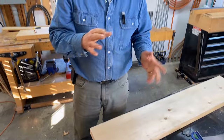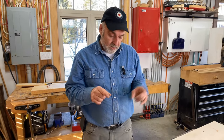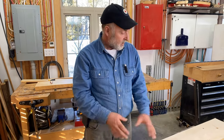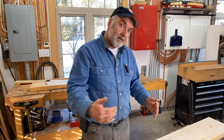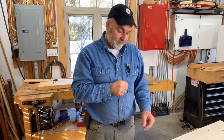I have to warn you about something just before I finish up: do not get discouraged. I first started working with wood when I was seven years old — I'm almost 58 now, so I've had half a century of experience. I've always used hand saws, at least for some of my work, so I've had lots and lots of practice. You will not be able to do this right away, but that's okay — you can just practice. You don't necessarily have to cut pieces for a project; you could practice on some scrap. It's just a matter of marking the line, paying attention to the reflection, and hand-eye coordination — skirting on the waste side of the pencil line. Keep it up and you'll have no trouble cutting like this too. Thank you.